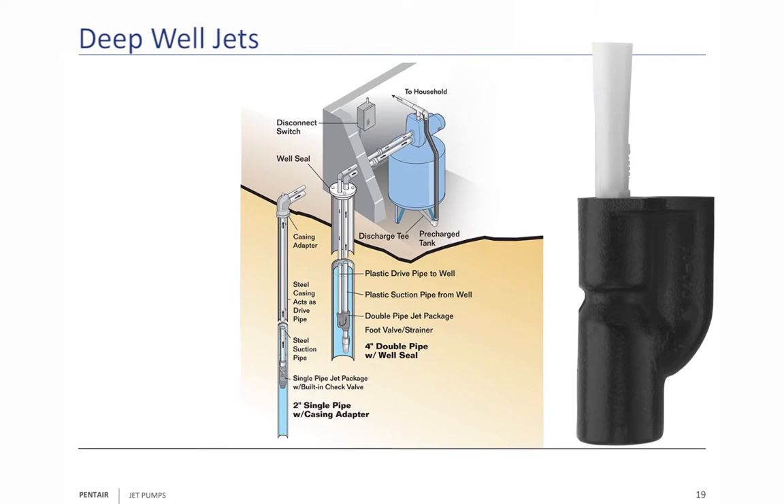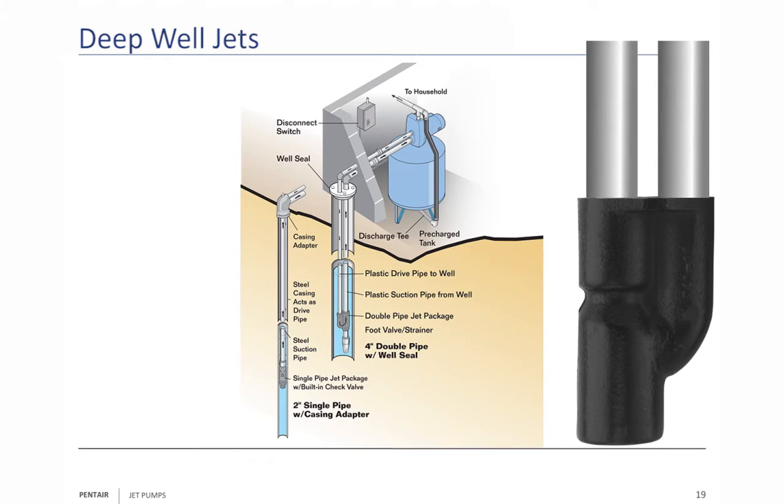The next one is a double pipe jet. The double pipe jet comes with a nozzle and a venturi tube. You're going to put a drive pipe and a suction pipe. Those pipes come up — the drive water goes down the drive line and into the base where the nozzle is, coming up through that nozzle. As it comes through the nozzle, it creates a low pressure system pulling well water into the mixing chamber. That water mixes with the high velocity water, goes up through the venturi tube, and we turn that high velocity into high pressure, allowing you to push water up from a much deeper depth.